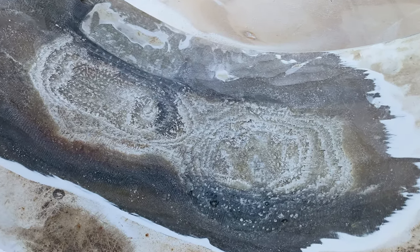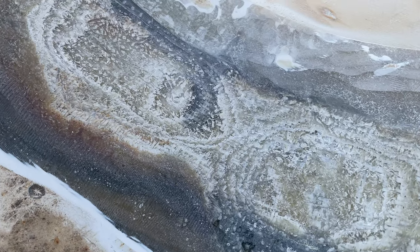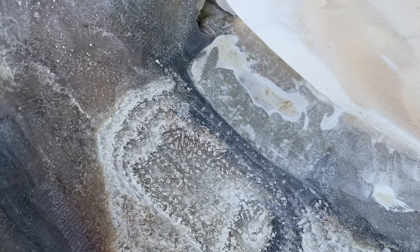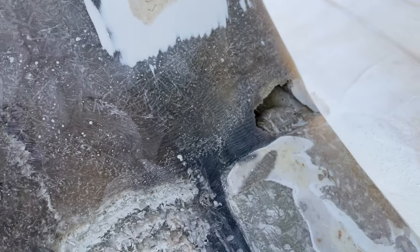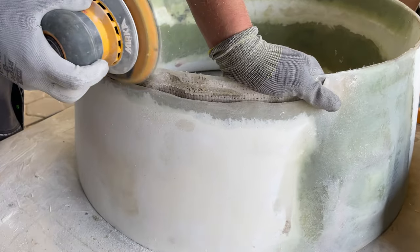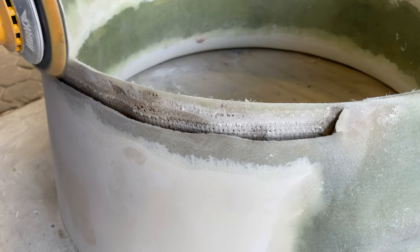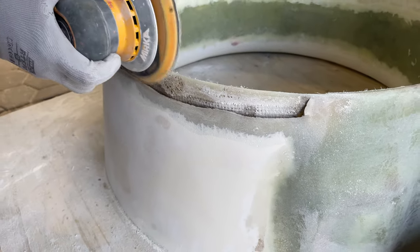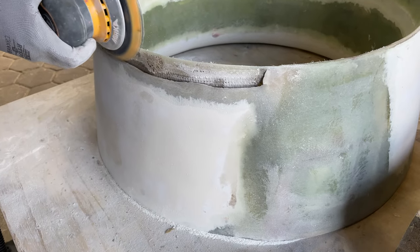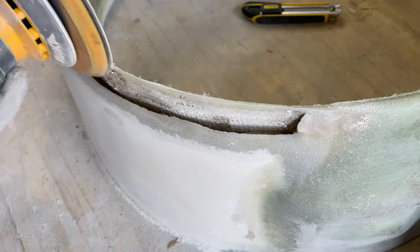For example, here you have white fiberglass with not much resin in it. If you keep grinding down until you get to the bottom of it, you have a hole. You can't keep grinding down more. So you have to compromise — removing as much material as possible without completely getting rid of the contours.